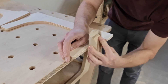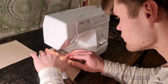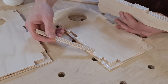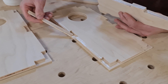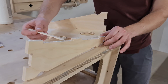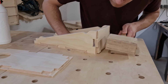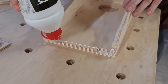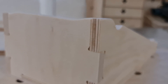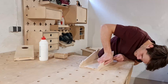Hand sanding gave me enough time to realize that I probably won't be able to purchase corn bags for the small tabletop game and will need to make them myself. But before taking up that challenge, I first had to glue the small field parts together. I glued the side components in place, spread glue on the back of the game field, and installed one side, then the other. Next I added glue for the back panel, attached the part — it needed some convincing to get into place — and finally glued the front component in. The joints weren't as perfect as I'd have liked; there was a small gap between the mortise bottom and the tenon, but it wasn't that bad. I then repeated the same steps for the second game field.